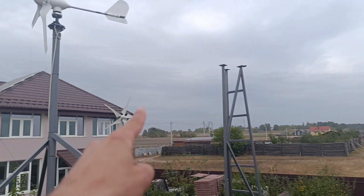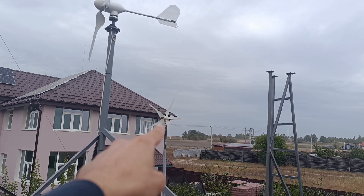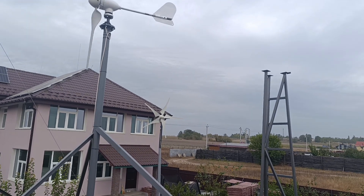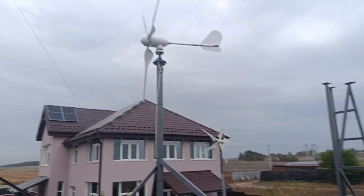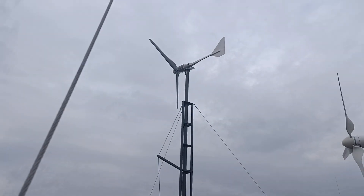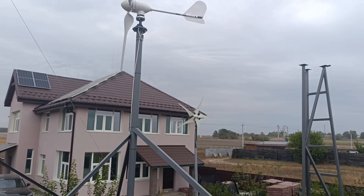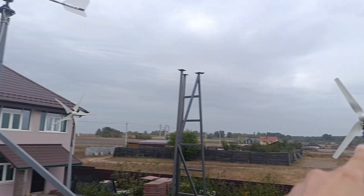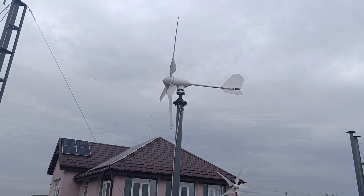We'll have to experiment with that, but it's room for expansion — technically I can apply this windmill here and it will work so much better. Because this one, despite having five blades, has a really slow start after the generator was updated to 15 millimeters thickness. It's the slowest start of all five. The first to go is this one, then this one, then actually the FT 2000 starts — the big 3.2-meter diameter one — then these two start almost at the same time, but this one goes faster in rotations because it has a smaller windmill. This one is always last, so it definitely also requires a bigger windmill — maybe 2.3 meters or more.